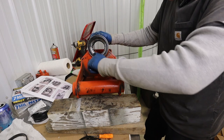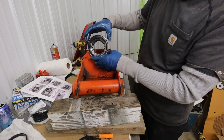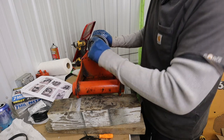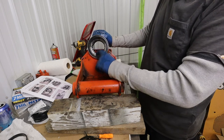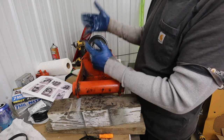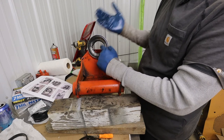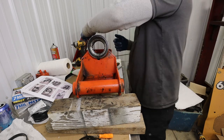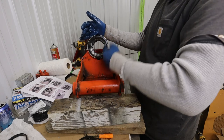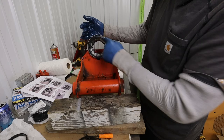A little bit of corrosion here. This is probably, I think, the top side. So, you know, water sits here and it may be kind of came in there. So this right here is not a surface that a piston or anything rides on. It's really just space. And it is on the hydraulic side of the piston pushing that way. So it's always got oil in it. But if we come in here and we do a little bit of that with Scotch-Brite, I don't think we'll harm anything. Same thing within here. We want that to seal well.